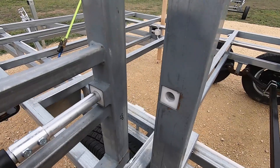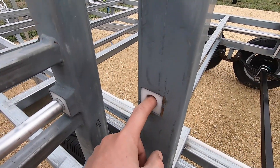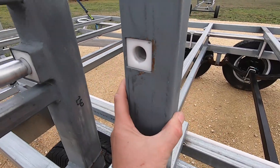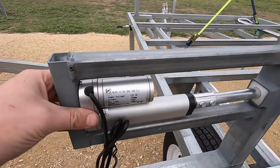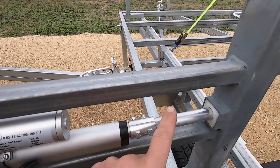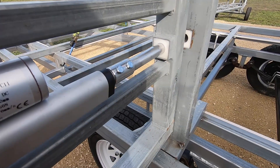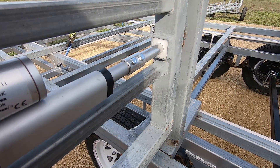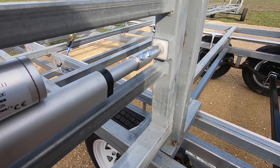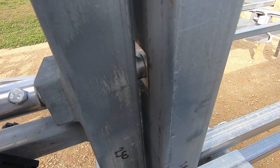The swinging walls lock into the side trailer by extending pins out the end of the wall and into nylon bushes recessed into the steel frame of the side trailer. I have linear actuators driving solid 20mm aluminium pins through the nylon bushes in the end of the wall and into my bushes on the side trailer. The linear actuators allow me to move those pins easily because they can get pretty tight, without having to pull the wall apart.